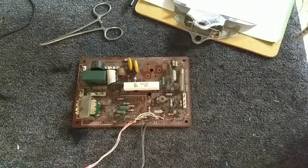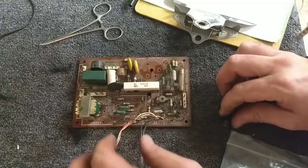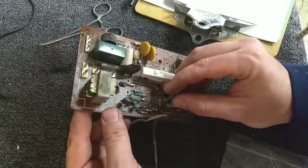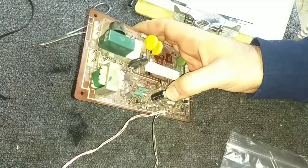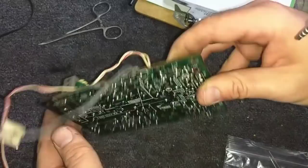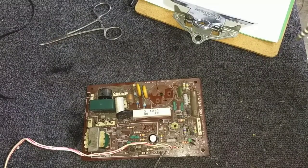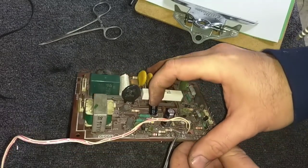And so that would be, let's see here. 10 microfarad at 160. These are actually a little bit higher voltage, but not going to matter too much. So we're going to do the 10 at 160. Pop this guy in here. See if I can shed some light on this for y'all. I bend the leads over on the bottom like that so that they kind of stay in place. And let's see here, what else do I got? We got the 4.7s. 4.7 high voltage, the 160. It's going to be next to the 10 there. Pop that guy in.